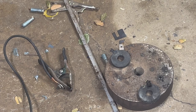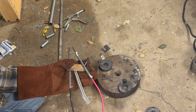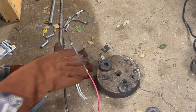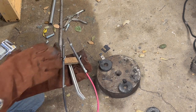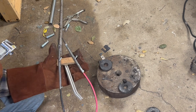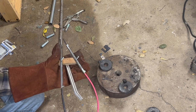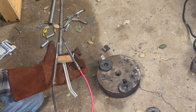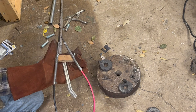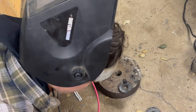This is what I came up with for my carbon arc torch — it's pretty close to what they originally looked like, where you have two rods that move in. I used bigger graphite rods, drilled holes, and used small screws to retain the rods, with six-gauge wire on the back connected to the stinger and ground clamp. I made a handle, though I originally made part of it out of metal and realized it was shorted out, so that was pointless.